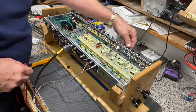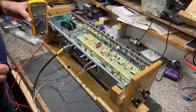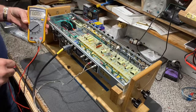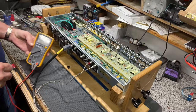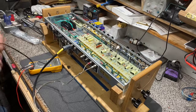I'm going to set all the tone controls to five, reverb everything off. I'm going to use this Fluke 117 here as my meter. I've got a bunch of other meters, and when I build amps I'll hook everything up at once to monitor everything simultaneously, but for now we'll start with this. Turn your amp on and let it warm up.